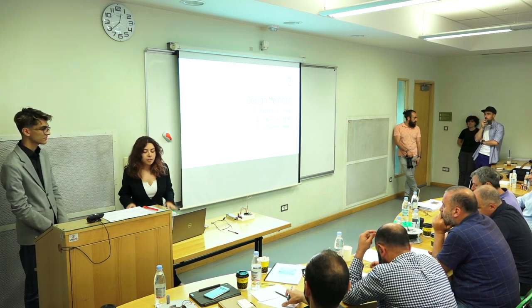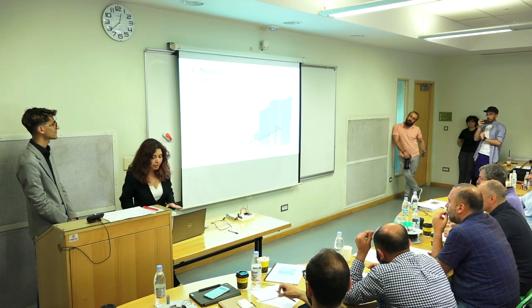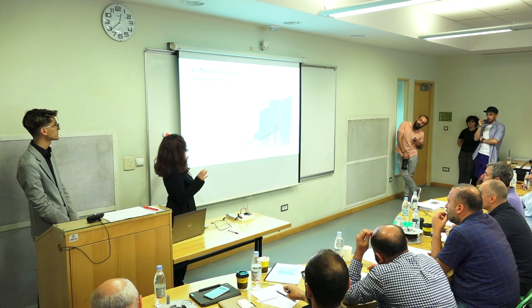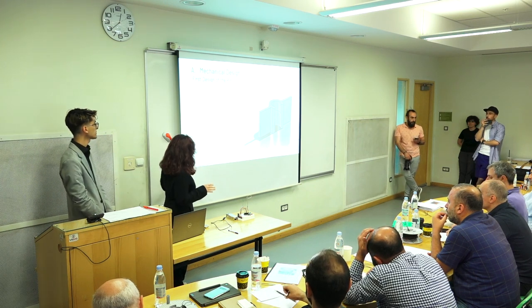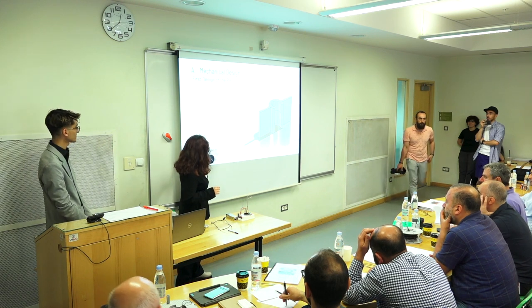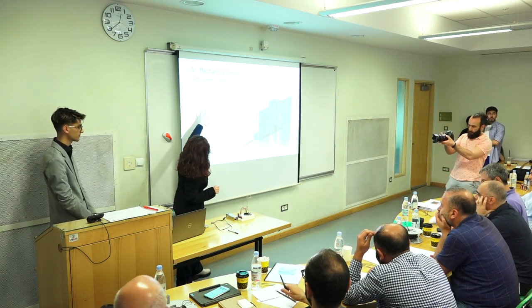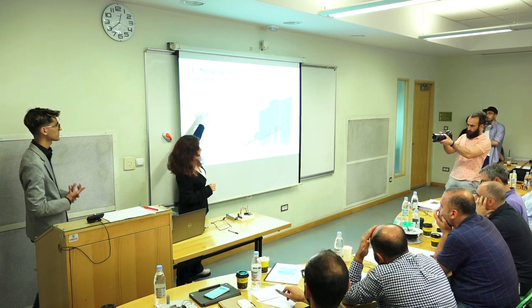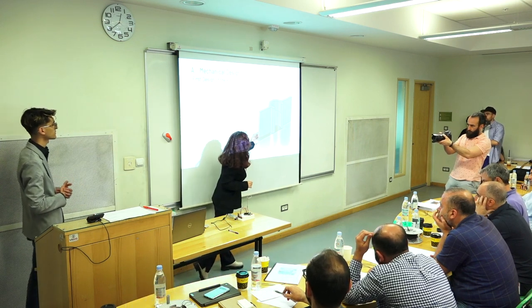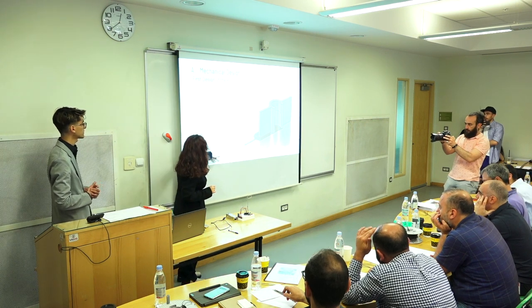We have three sections: mechanical design, electrical design, and software design. So let's hop into it. So the initial design of the pen was the following. This would be a non-metallic core, a magnet here, another magnet here, and two metallic washers here. This magnet would be stationary, held by this printed cover. And the pen would move inside of it.